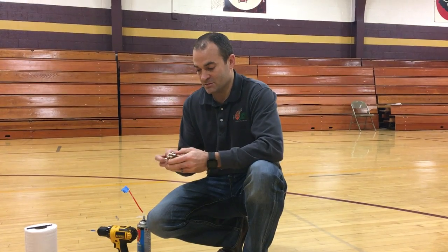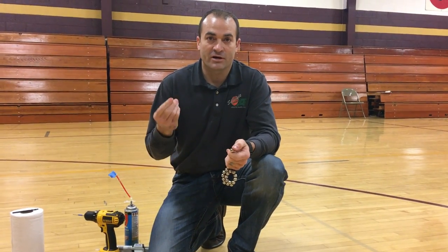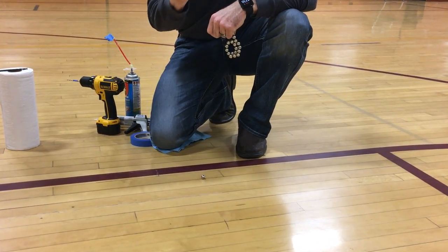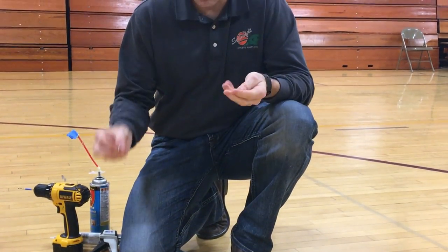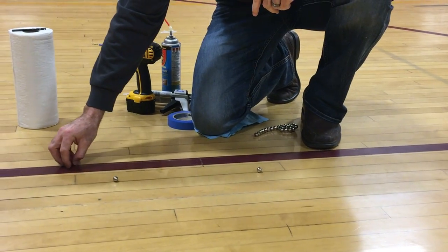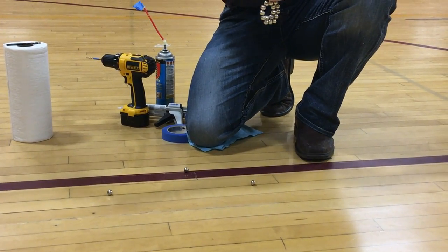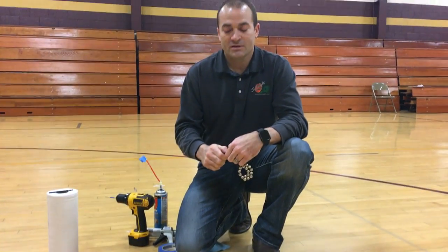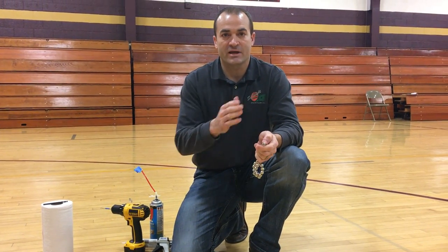The first thing to check — and it's really important as an installer or a company that does gym floors — is whether the floor was nailed correctly. According to our association, you should install a floor 12 inches on center where your nail goes. These magnets can actually find where the nail schedule is. You can run them along the board joint and try to decipher where the nail is. One of the main culprits to a dead spot is an older system like a sleeper or a 2x4 that would run perpendicular to the maple, and with your magnet you'd pick up rows where nails could only go in through the wood.